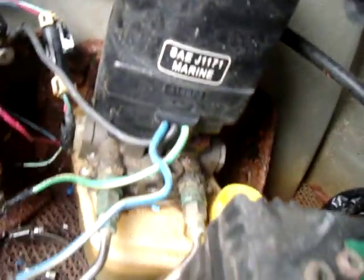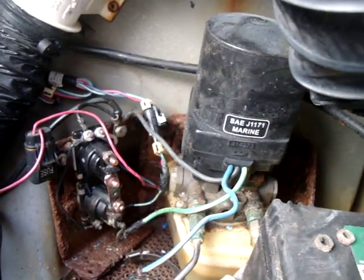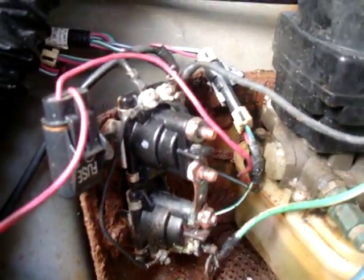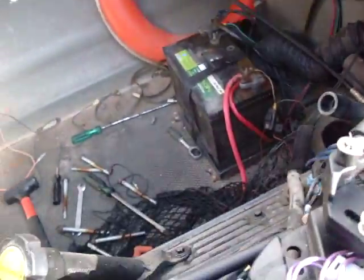After stripping the engine, one thing happened yesterday when we took the boat out — the trim was not working. In order to be able to tow the boat, I cut the main trim motor cables — those blue and green, the hot and cold wires — and I lifted the trim using a direct battery connection, changing the polarity to trim up the gearbox. This trim motor bracket is very rusty; all the bearings need to be cut and rewired. This is extra job for the trim.